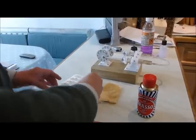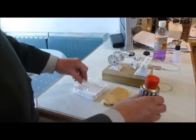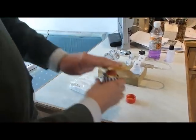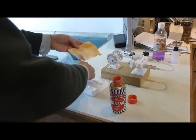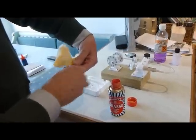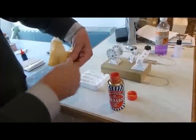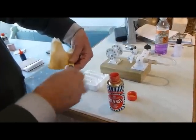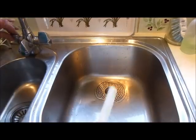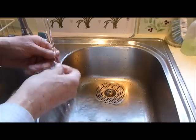How do you stop one of these syringes from gripping or binding when they get hot? You use Brasso. I tend to use a piece of kitchen paper — you grip the plunger in the paper and twist it round. That uses a quantity of the grinding grit that's in there. Do that all over again twice more. Finally, wash the Brasso off with water, then dry it off with a cloth and you're ready to go.